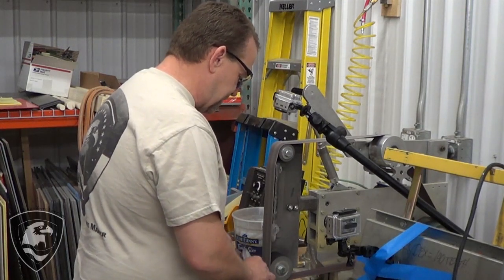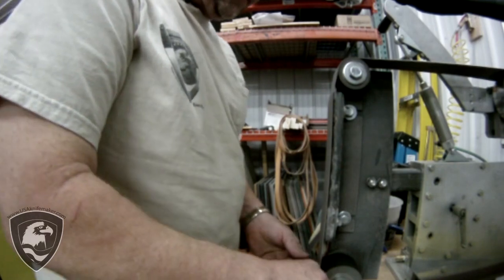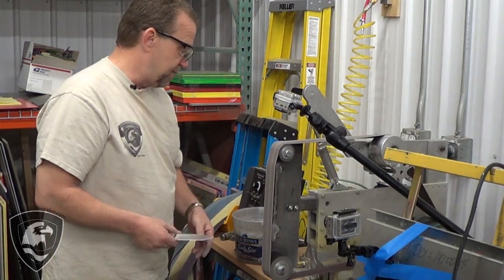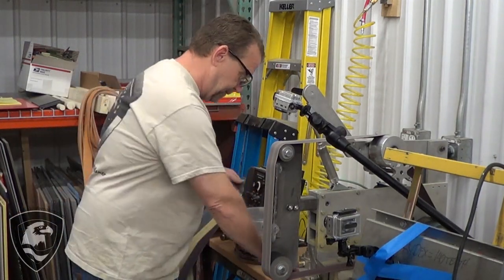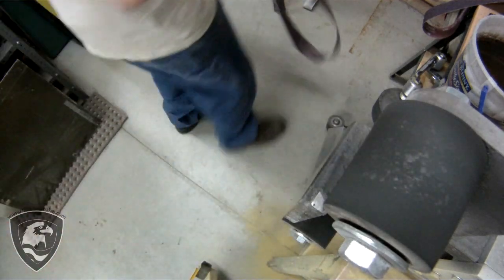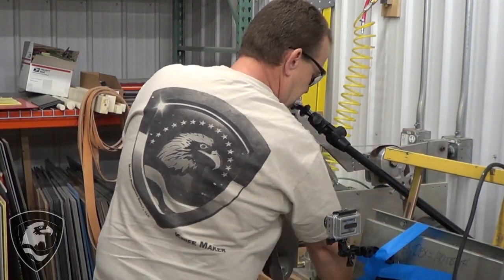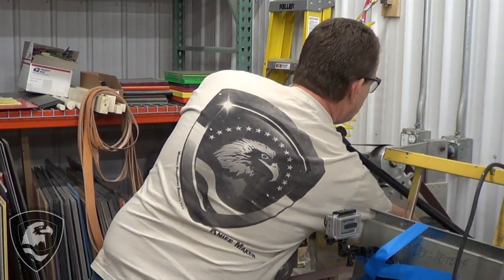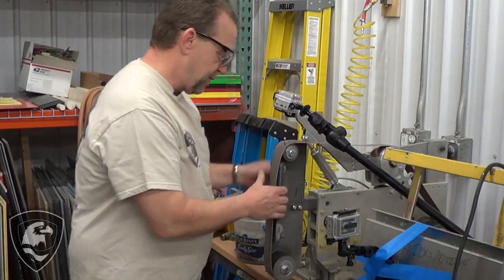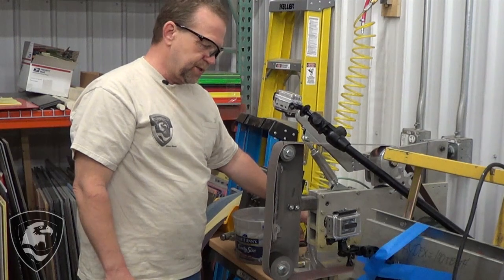As you gain more experience in sharpening, you can skip some of these steps. I've found that skipping a belt step always makes me go back and end up losing time, so I use four or five belts. Use as many as you think you can get away with — it really just takes four or five passes on each one. That's the 100X done. Now we're going to switch to a 65X. The belt progression is really what's important — it doesn't necessarily have to be a Norax. Basically I go from 120 to about 220, then around 400, and end up somewhere around 1100-1200 on the 5X Norax. Then I'll step over and touch it on a buffer just to knock off the final wire edge.